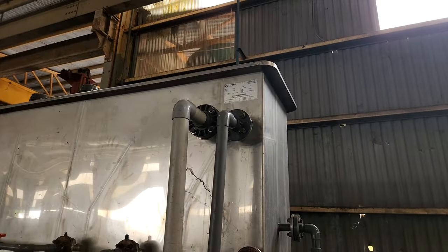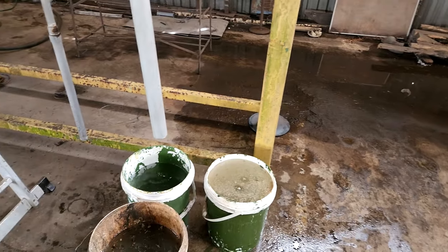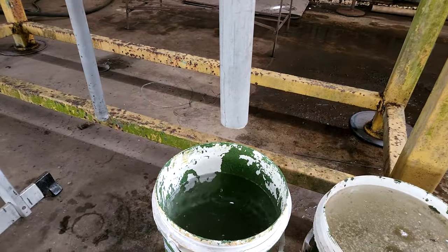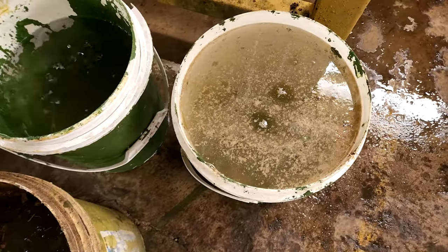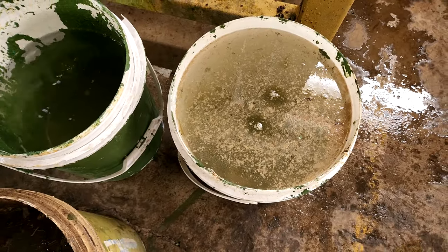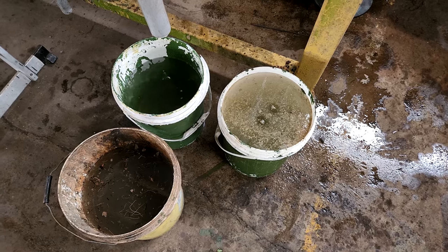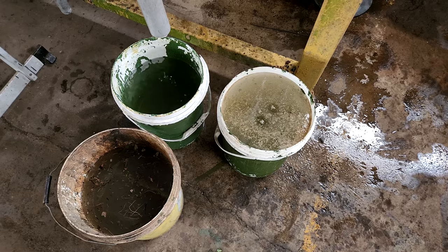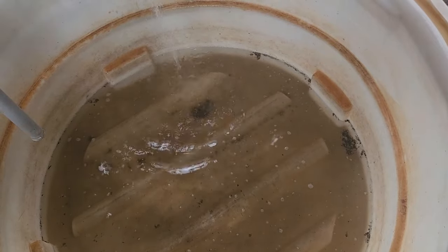You can see two pipes here. One pipe is where the clean water leaves from the DAF unit, and the 2-inch pipe goes to a waste collection bin, as seen last week. What we realised is that if you use too small a bin, it tends to overflow very quickly. So we needed a larger container that can accommodate more waste given the time we are in operation. One of the key variables to consider is the volume of waste water generated. This is how the bigger container looks like.